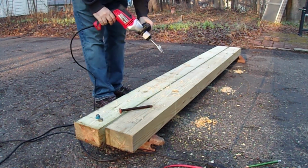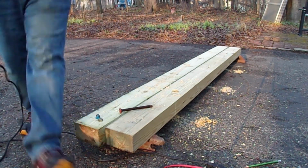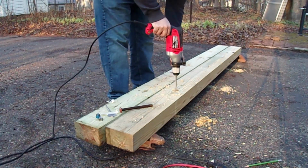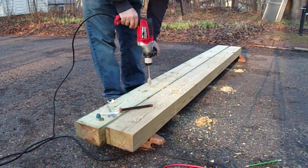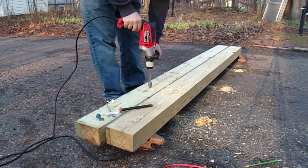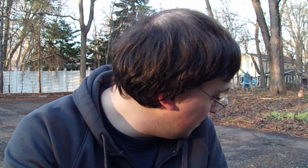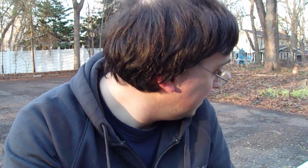Maybe it'd be better not to do that size difference all at once. Alright. See, I was wrong. You do want to do the whole hole at once, and you want a small hole as possible in the middle. So, learn from my mistake, because I now have really big, ugly holes countersunk in the back of my playset. Which is fine. We'll deal with it. You're not really going to see them. They're going to get stained over anyway, so they should seal over time. But yeah, full-size hole all at once.